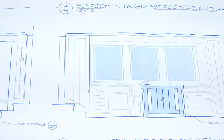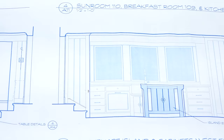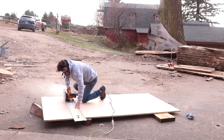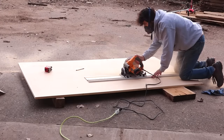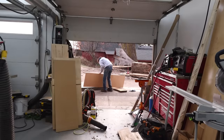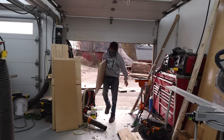But I'm going to get started by just making the V-groove paneling stock. That's going to be from that water resistant MDF stuff again. After I figure out the actual remaining width I'm going to need, then I'll go ahead and make all my strips, and I will glue them back together using my chamfer and smaller bearing technique, because it's just easier for me.